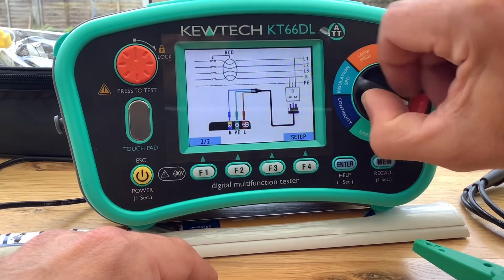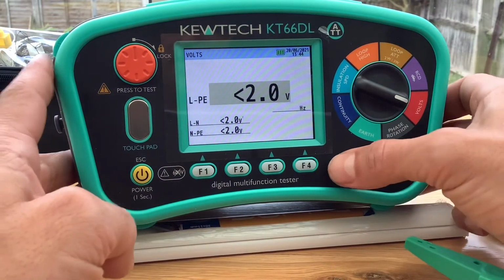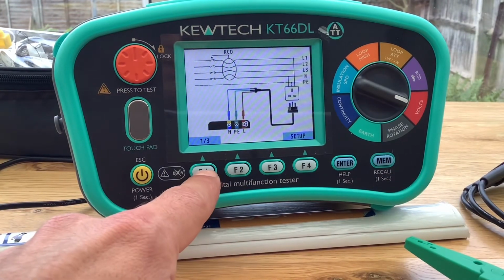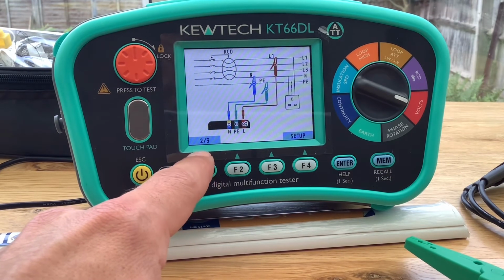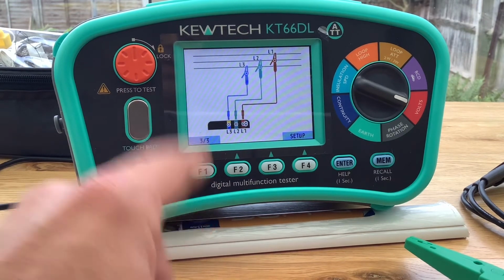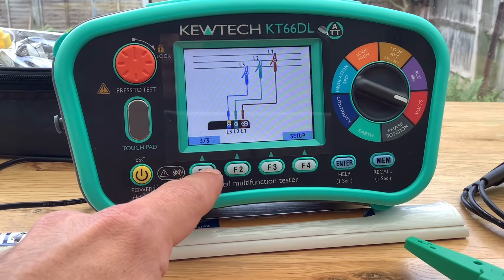And if there is more than one option of how to connect, as you can see here, we've got 3 different options. You can use the plugs, you can use a 3 lead method, going to L1, neutral and your CPC, or all 3 onto the 3-phase setup.